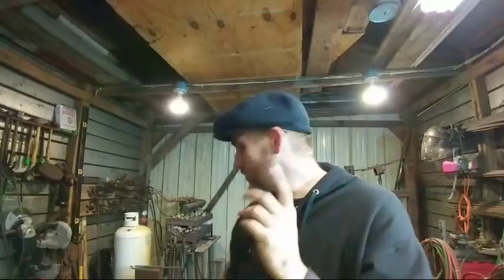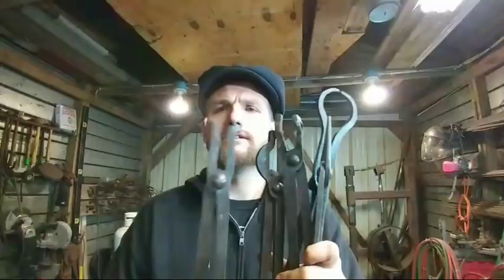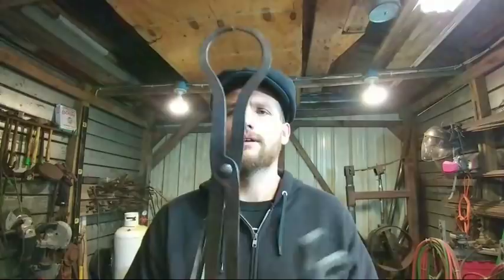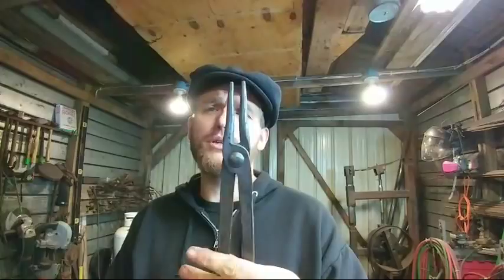Thank you, Eric Davis. Yeah, they're a very nice bed of tongs. If you give me just one second here, I'm going to grab all the various tongs I've made, which we've got videos coming up. All these tongs that I've made recently are the knife-making tongs, the bolt jaw tongs, the pickup tongs, the railroad spike tongs, which was just a recent video, and the scrolling tongs. They all came out of the same size piece of flat bar stock: a 1/4 inch by 1 inch by 10 inch long bar. Every last one of those came out of that. So it's a very, very easy method that I like to do for my tongs.